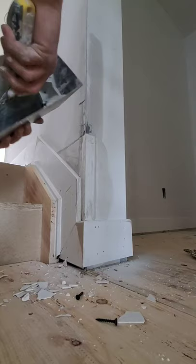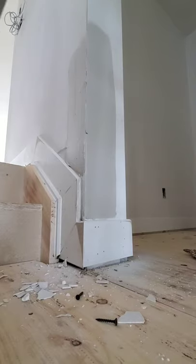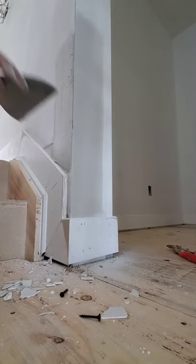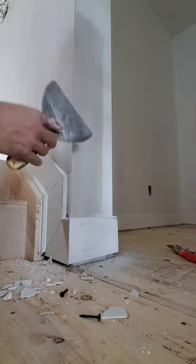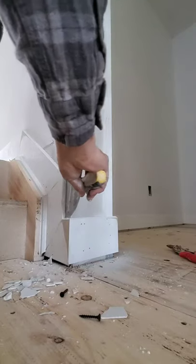All right. Now, we'll add some sheetrock to that, a bit left over top of this to give us a head start. What I've done is I've added a nice coat of sheetrock onto the beads to hide it for now. As you can see, you can almost pass that on one coat. Because if you know how to drive your knife, you don't let it drive you. You've got to drive it. But once you learn how to take control of the wrist and the hand movement on the knife, you can hide anything. A little spot here.